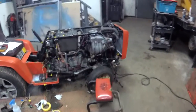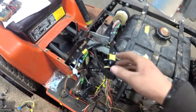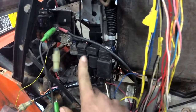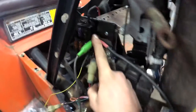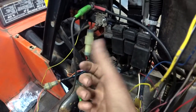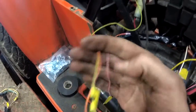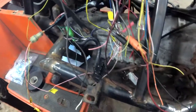Okay, there's going to be a little second part to this video. I already had the wiring harness and everything in a little bit — I mean, it's a wreck right now. But in here you can see I have three relays. This is the main relay, this is going to be a cooling fan relay, and that's the fuel pump right there. This is a little leftover fuse panel we had from an ambulance. Basically this is the main power feed connector for the fuel pump system.